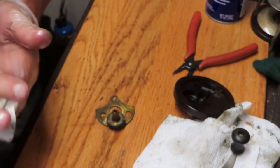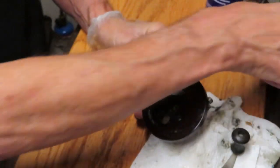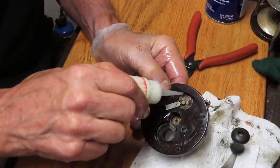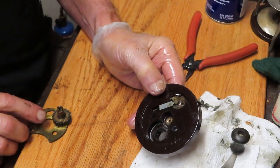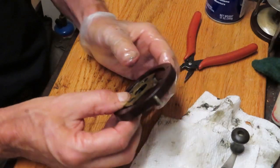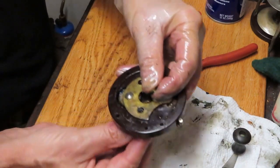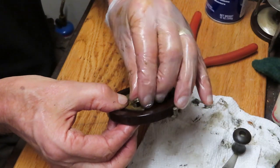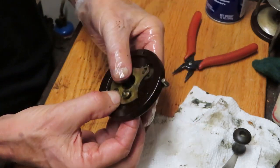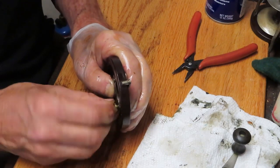Let's grab this assembly. Make sure you don't disturb the spring mechanism — we didn't take that out. You could, but you risk shooting that spring. Put a little oil in there and a little bit of oil onto the eccentric cam as well. You don't need to move that lever unless you broke something in it or it's really tight — then take it apart and clean it. Bring the main screw through and start the screw on the opposite side. Hand-thread these if you can — these are brass, and if you're not careful there's a good chance you'll ruin the threads or cross-strip them.